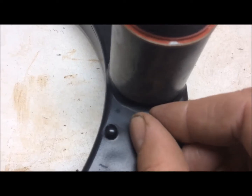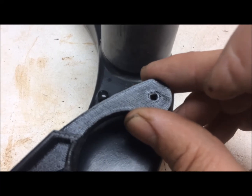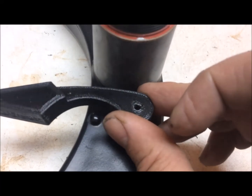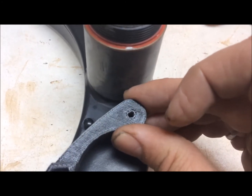Position the D-shaft in this sort of position. You're going to want to put the lever on in this orientation with the D-hole aligned. Make sure you don't put it on behind this pin because it'll be stuck and you won't be able to move it — so put it on in this orientation.